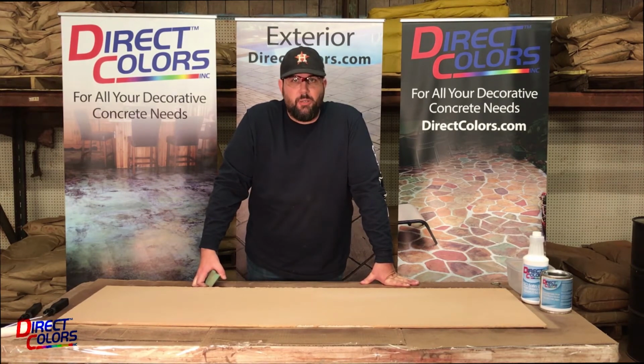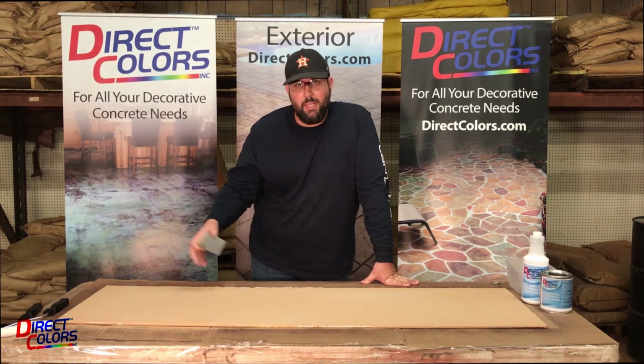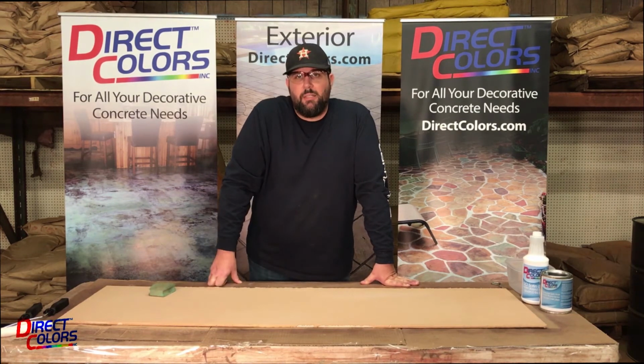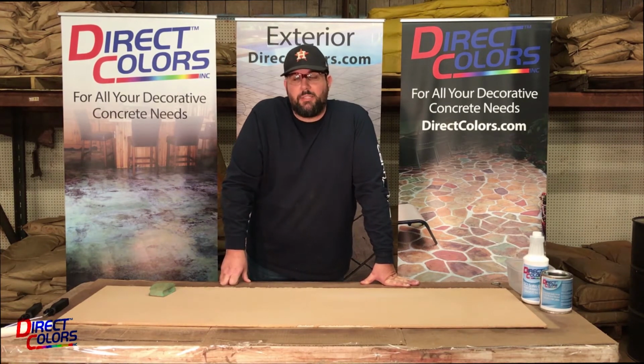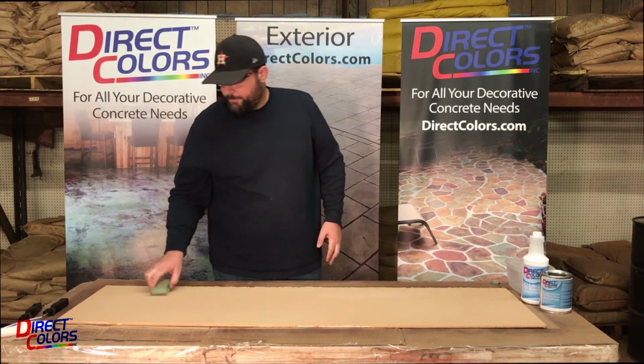We're going to move into showing you the sealing process now. What I have here are 2 of our most popular floor sealers. They are acrylic sealers. I'm going to do half of this in a solvent-based, half of it in a water-based. I think it's important to show you that because there's a dramatic color difference between water-based and solvent-based sealers. This will be a great way for you to see it. A solvent-based does pop the color intensely, several shades more than a water-based, but we'll go ahead and get to that, and I'll show you what it's going to look like.